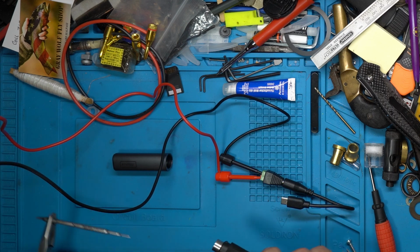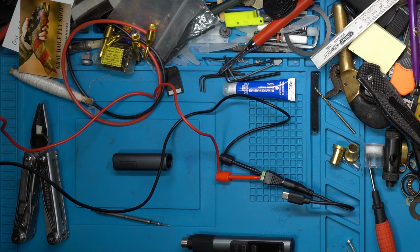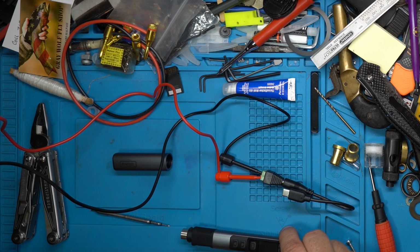Because what I'm thinking now, and please comment below and tell me what you think, because you guys know more than I do. That's obvious. I mean, you showed that already. So tell me what you think. I believe this iron will drop the voltage. It's set to 20. You can see in there when I'm checking it's set to 20 volts. But it'll drop that voltage when your current supply is maxed out. It will continue to heat, but it drops the voltage so it doesn't pull too much from your power supply. And then I think once it gets down to a low enough voltage that it can't properly operate, it's just too much amps and it can't compensate anymore for the power supply, and the power supply starts to trip out because it's pulling too much.